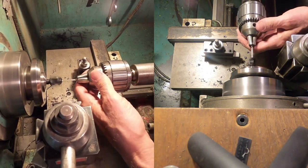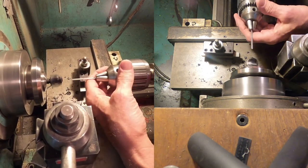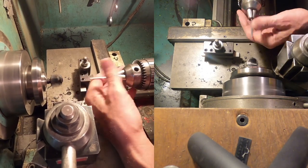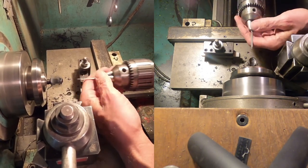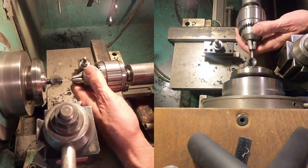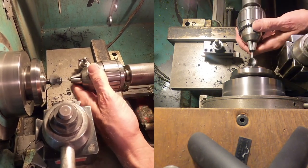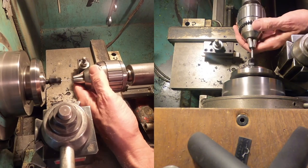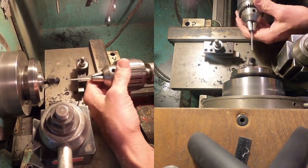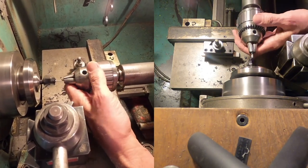in one shot with any drill, because we're drilling a hole that's over an inch long, and the drill is only 1/8 of an inch diameter. So it means we're going, well, it's actually probably more like 10 or 12 drill diameters, which is a challenging depth of hole in any material with any drill.